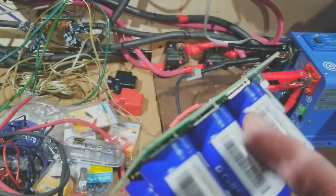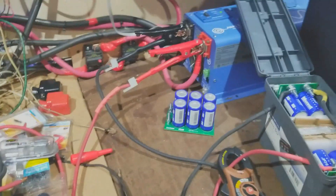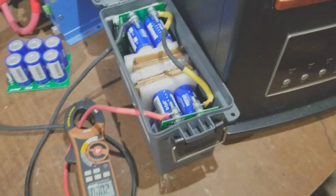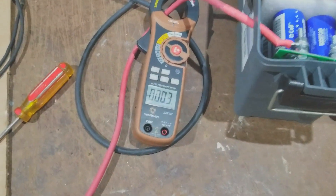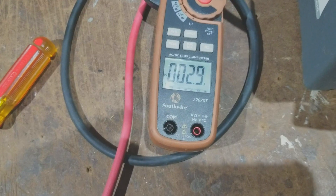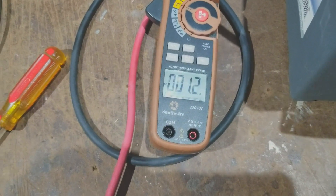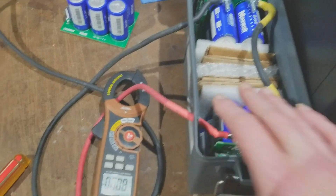You could charge one of these up and make a little mini rail gun — this will shoot your mini rail gun off; it'll unload quick. This is a 24-volt version pack I built here a while back. I just kind of stuffed it in a box and kept everything separated. Right when you turn it on, it gives a little surge — about three amps — then goes to high heat and jumps up to four, but then it settles back down because that surge is absorbed. That's how all that power surge is being taken by these capacitors instead of your batteries.